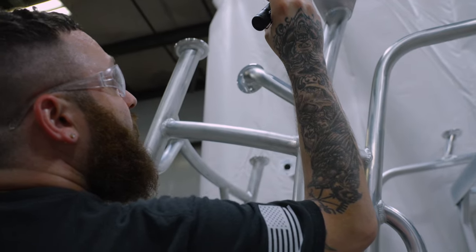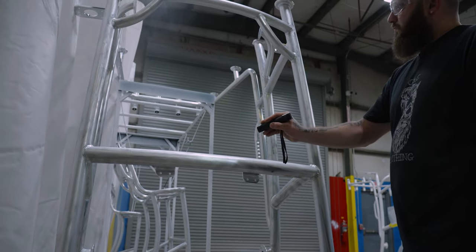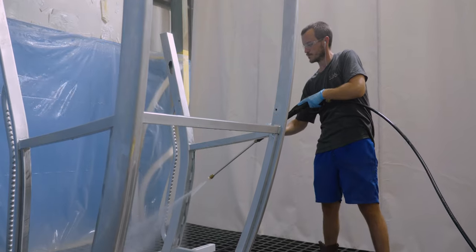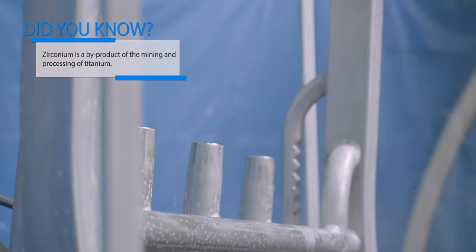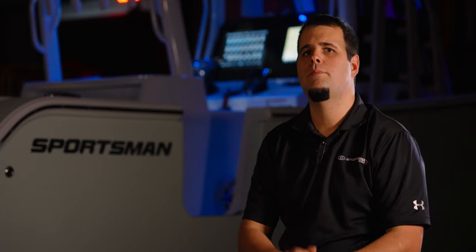We utilize a multi-step process proven to be tough and durable. The completed parts are delivered to the powder coating room where a quality technician inspects for defects in the welds and other minor quality issues. Proper pre-treatment of every part before powder coating is the most important step for great performance and longevity. The prep process begins with an alkaline cleaner that removes any dirt, cutting fluid, grease, rust, oil, and other contaminants, followed by a high-pressure wash. What really sets our process apart is the next step: using a low-pressure sprayer, the technician applies a zirconium acid pre-treatment that chemically reacts and converts the surface into a thin film of zirconium oxide, dramatically increasing adhesion of the powder coating and improving durability, corrosion resistance, and salt spray performance.